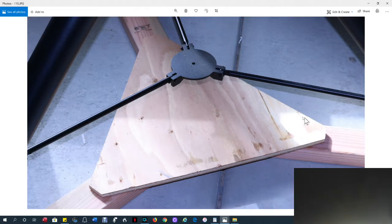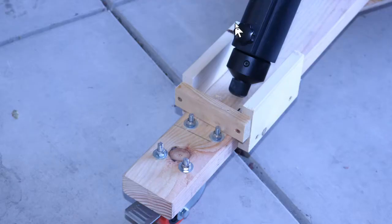It's very easy to screw this up. The last step is to mount the wheels. You don't have the tripod sitting on the dolly at this point, but you have mounted the parts and assembled everything together with the triangles. Place the wheel on top of the board with the flange against the board so the edge of the flange is one inch from the end of the board. Once each wheel is centered, drill the mounting holes for the 5/16-inch bolts. Lift up each tripod leg and bolt the wheels on underneath.